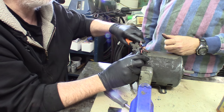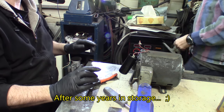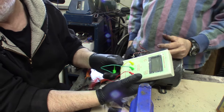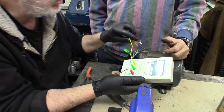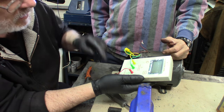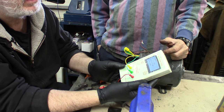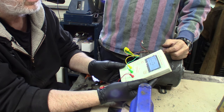I don't know, maybe there's still some remnant charge. Not now. The capacitor, look underneath there, maybe it's there, I'm not sure. Either your Greenlee or, oh, this? That little thing. I was trying to keep it clean, but forget it. Not with me around. That's a nice little tool, though. You just connect any wire, any lead on this, to any component or just about, and it's going to tell you what it is. Doing a test, testing the battery itself first. Then it's a 133 microfarad, loss 1.8%, ESR 0.06 ohms. Sounds good.